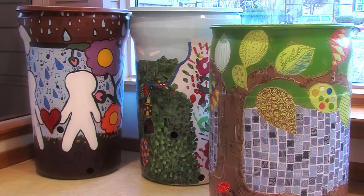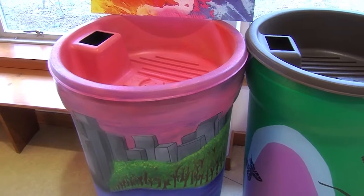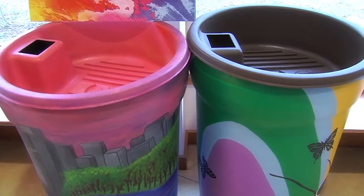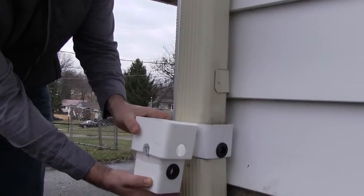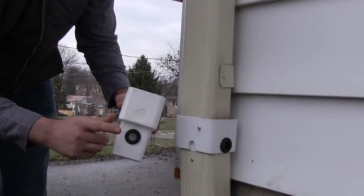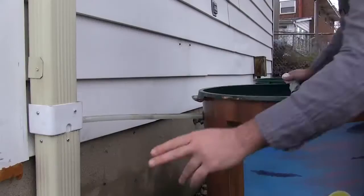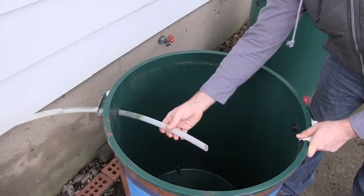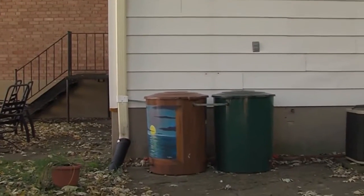Installation is simple and all the parts are included with the rain barrel kit. There are several different ways a rain barrel can hook to your downspout. Be sure to check with your installation guide for further details. In this example, we have attached a water diverter to the downspout. When the diverter is installed level in relation to the rain barrel tubing connector, the rain barrel will fill and excess water will be directed back down your home's downspout.